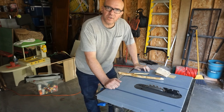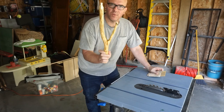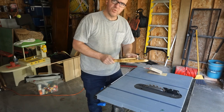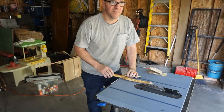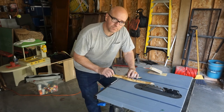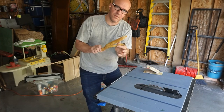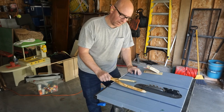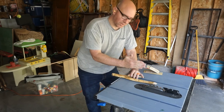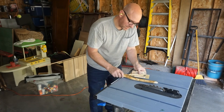Once you have debarked your branches, the hanger portion needs a flat side to mount to the wall. To do this I'm using the table saw — use a jointer if you can. You need to run it through the saw keeping the hanger portion parallel to the table saw table so you get a nice perpendicular cut on the back side.